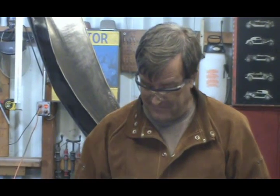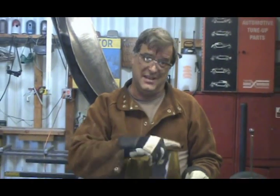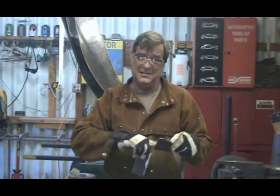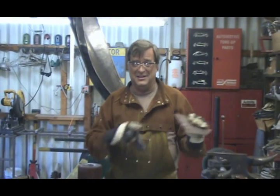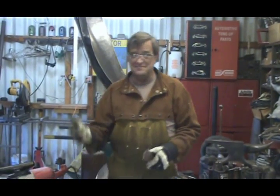So that's what I've got to do — clean these all up. And this is important with MIG. It is even more important when you're TIG welding. Clean, clean, clean. Got to be clean. That's how you get your best welds. Back to work.